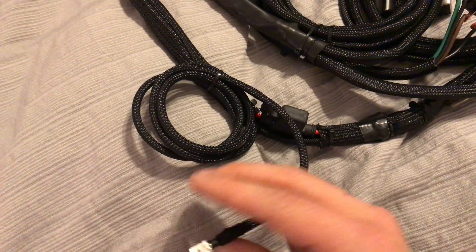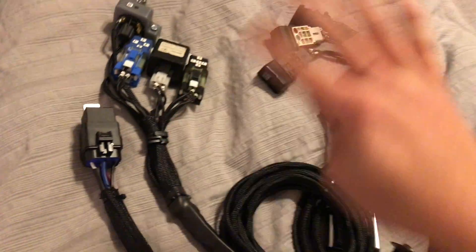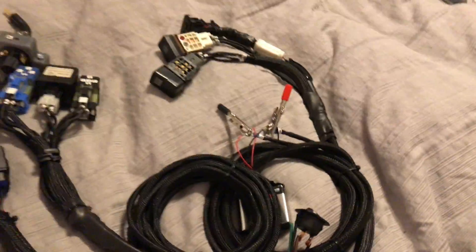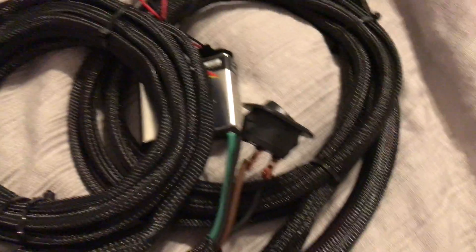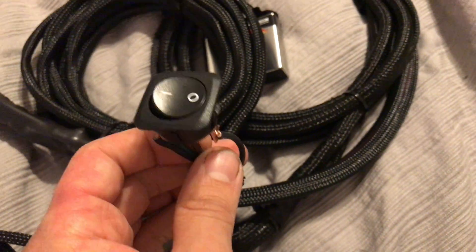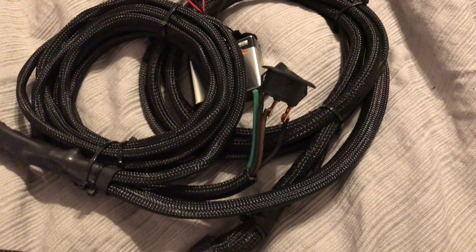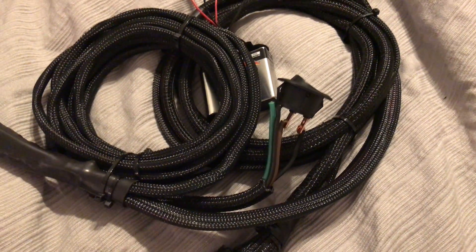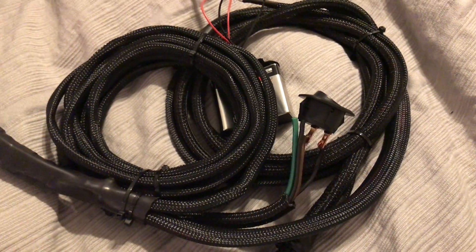This will just go right in — when you turn the key on, it'll turn all of this on and get power. We're simulating over here power to two 9-volt batteries. This is going to simulate the water level switch: when it completes the circuit, that means the buoy has dropped to the bottom and is now allowing electricity to switch the orange light on on the LED. The little green wire is going to be power to the pump, and there's also a ground down there for that.